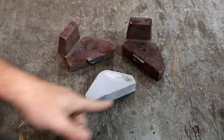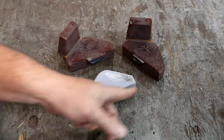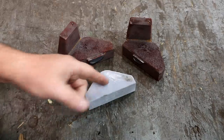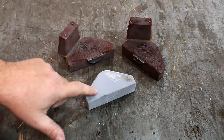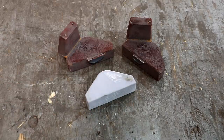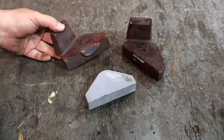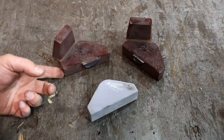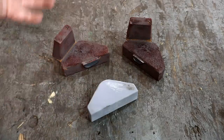I will have to face the front of this and put that V mark in there, as well as drill the hole that goes in here for these to pivot on. So there is some machining to be done, but this is basically the pattern that we cast these from. And these are the actual castings that we got back — they were put in sand and we molded them out.